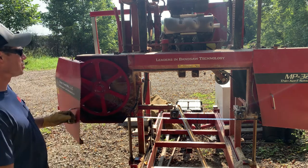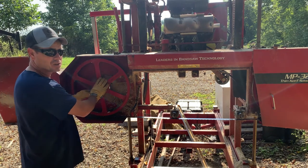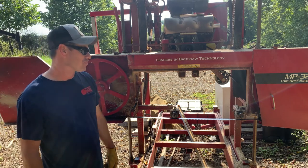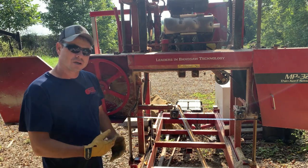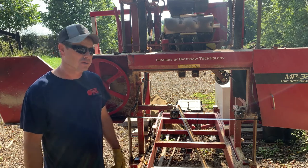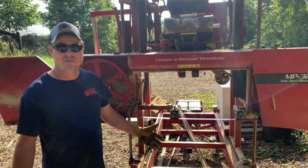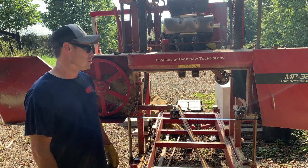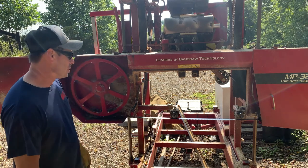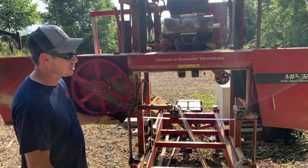You don't have to put that much grease in them. This wheel inside is a sealed bearing, so there's nothing to do in there. The drive side has a tapered roller bearing with a grease fitting. I was greasing it every three or four times I ran it, but come to find out that's too much — they said every 500 hours. So I haven't greased that for a while now.